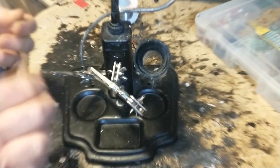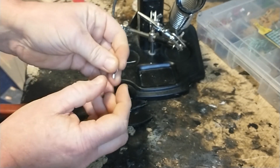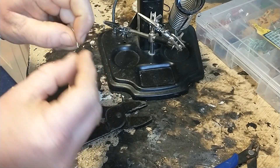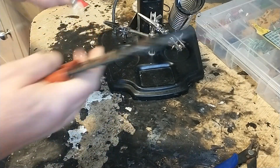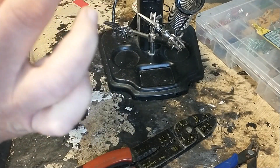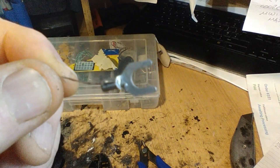And the other end — twist that up the same, and then we'll crimp. Just trim that, then crimp that end on. I know this connector is a bit too big for this wire. I'll crimp that up. So, got solder on that end and plain wire on that end. We've got one end just crimped on and the other end soldered on.